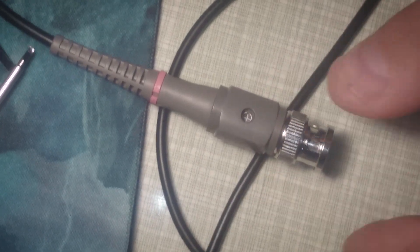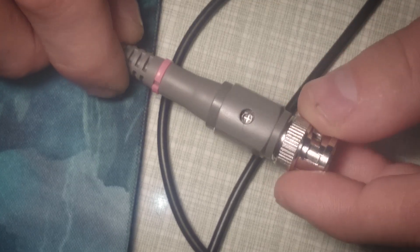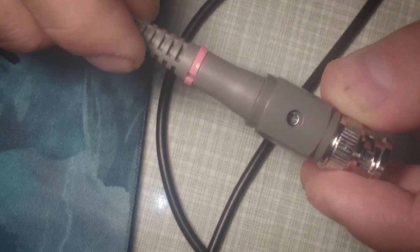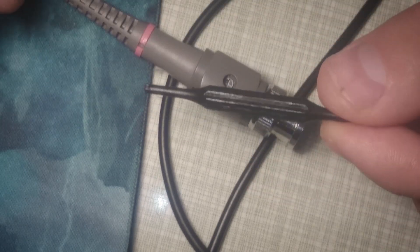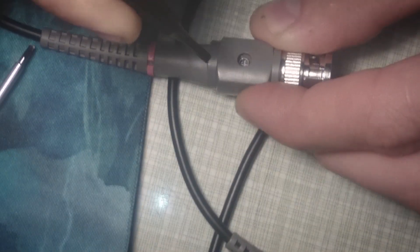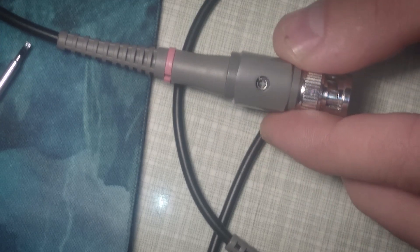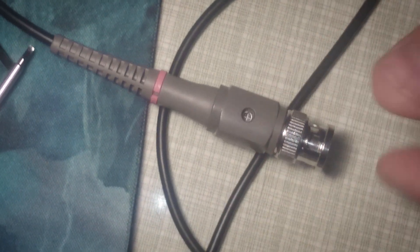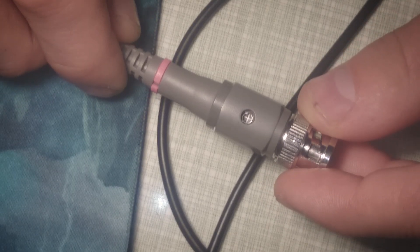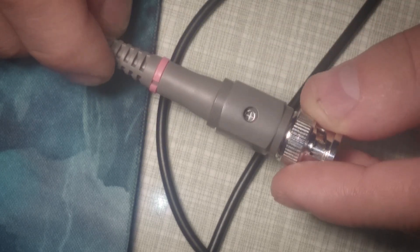It's pretty straightforward — just get a different plastic screwdriver, or some type of tool to adjust this particular screw that's not going to create any interference. Some of you might get the idea that you should simply push down harder with the plastic screwdriver and then rotate. While this makes sense in mechanical work, this is actually an adjustable or variable capacitor, and I have read online that some people have pushed down too hard and actually broken through this adjustable capacitor. So it might not be a good idea to do that. Even if you're using a metal screwdriver, you should be extremely careful and very gentle. Maybe a good idea is to coat the metal screwdriver with something and then use it. Really, it's up to you, or just simply get a different plastic screwdriver and you should be good to go.